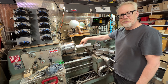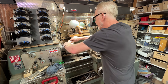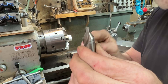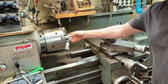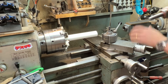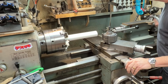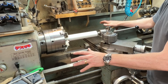So how do you affect a piece like this on the lathe? I simply chuck it close to the end, face it, and then use a centering bit. These are so beefy they can't move in any way, and they help you guarantee a concentric centered hole. You chuck that in and do that — now you know you've got a centered hole. You then bring this out to the degree you want, and you go get what's called a live center. That's this — live means it spins. I chuck that into my tailstock and put it in the hole I've made, which I know is on center, and then the whole thing turns concentrically.